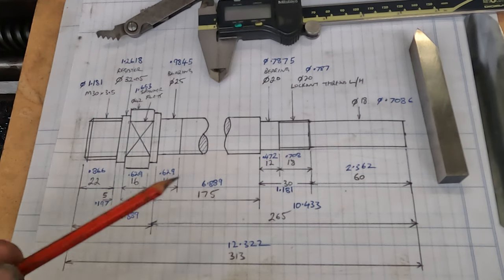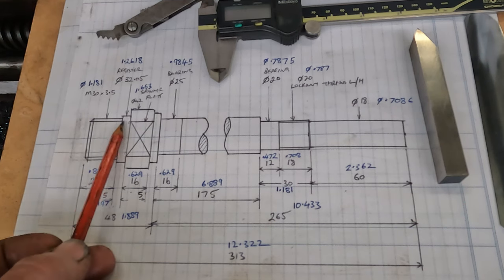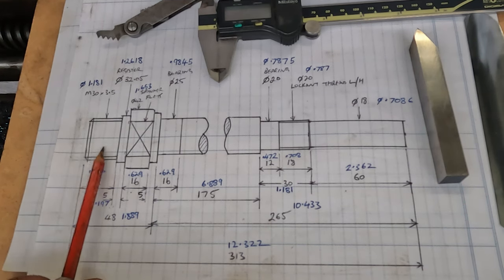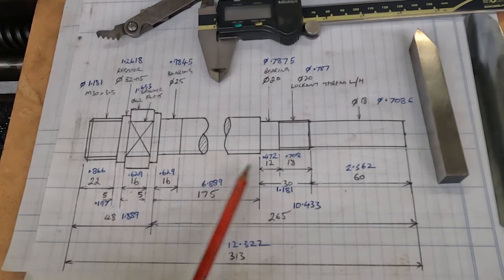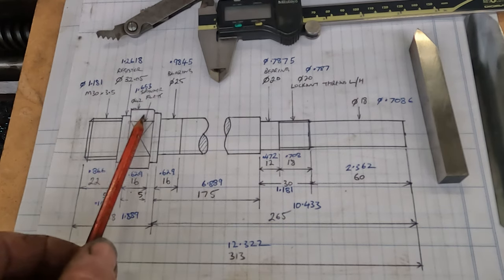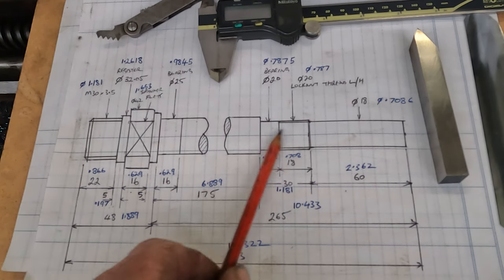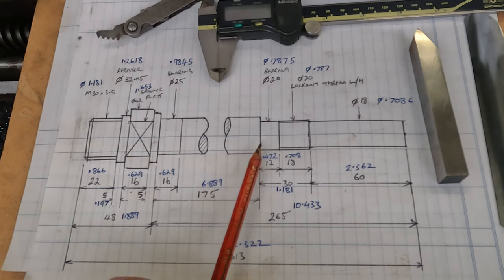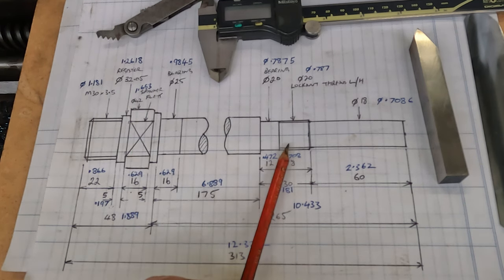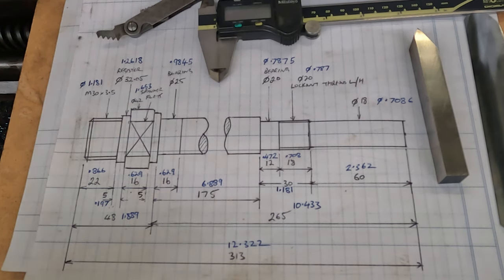We have to do this in the Heron lathe, as our smaller lathe cannot accommodate the 3.5 pitch thread. So we'll get as much of this done as we can in the Heron. At least we'll get the thread done, and the rest of the shaft roughed out. We'll see how this thing goes holding tolerance. The fine thread there, we'll probably definitely do in the smaller lathe. But we'll just see how the lathe goes. We'll just do as much as we can.